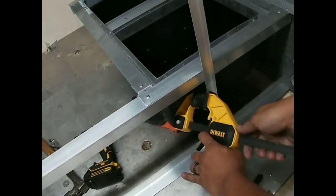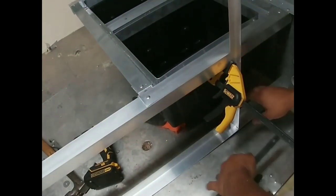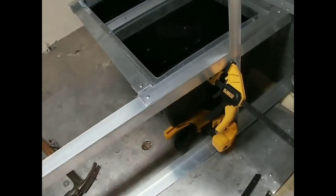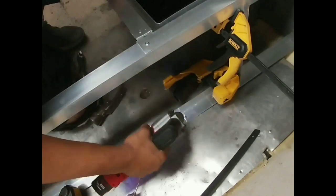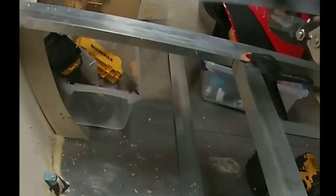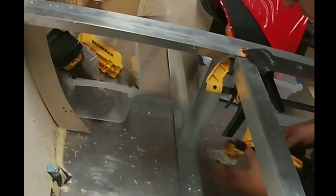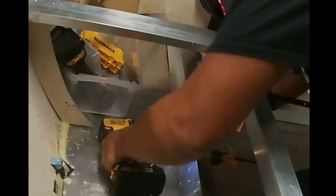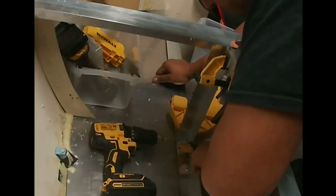In this section we're going to end up using angle for everything — I'm trying to get rid of the tubing. We're going to run half inch angle in 10 inch to 1 foot increments. It's actually pretty strong, especially if you're spanning them about a foot across. We're using this 3/4 to line up the bottom rail. We have to run a bottom rail because when we put that port frame in there, parts of it laid out right and parts of it bloated, so without this we're not going to get a straight run. All these sections are going to be put in to run an inch and a half thick foam wall. As soon as we get this all lined up, we more or less have the section for the rod locker in, and then we can really start doing cool things for the rod locker.